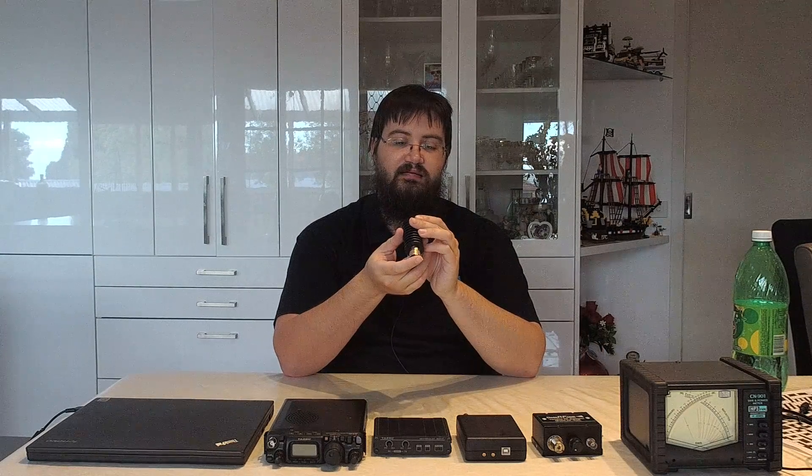The last thing you definitely need is a dummy load — and a suitably sized one. I'm using a Diamond DL50A, rated at 15 watts average power, which is three times what the FT818 can put out, so it's suitably sized. In Part 2 of this video I'll run through actually doing the test. If you just want to acquire the equipment, I've explained everything you need to know here, but I do hope you watch Part 2 — you'll see all the test equipment in action. 73 from Jared VK3BL, Rate My Radio, catch you soon.